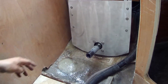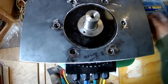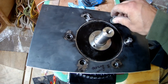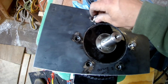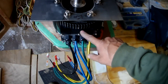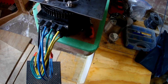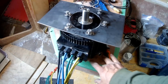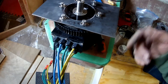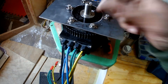I'm just going to put the motor on and put some blocks underneath it to support the weight because it's pretty heavy. My bolts aren't quite centered - I did my best making a paper template but the bolts were off a little bit. I made the holes a little larger than the bolt, and when I put the washers and lock washers on, it's not going to move. I've got wires dead center on top and I've also got my liquid cooling in here now. I'm going to try to get the liquid cooling done this year - last year I ran without it and it never overheated, but for longer journeys you'll want liquid cooling. I'm going to put a small heater core radiator with a fan and pump some glycol around.